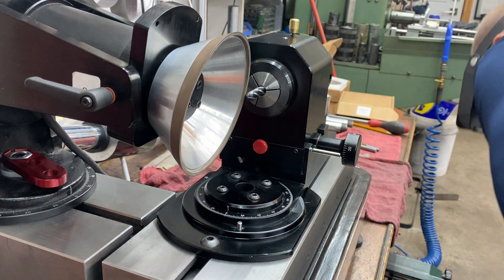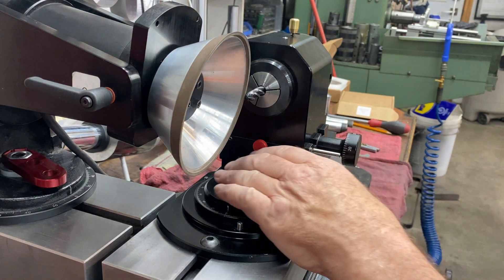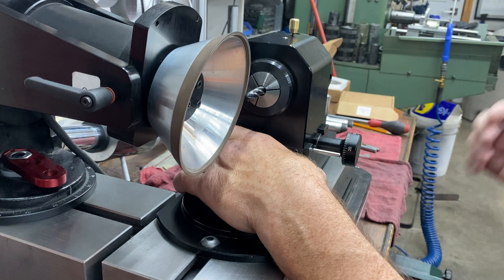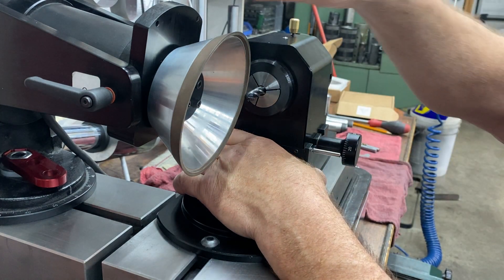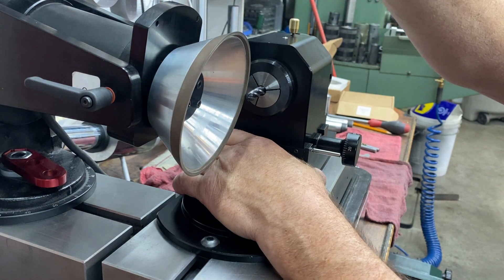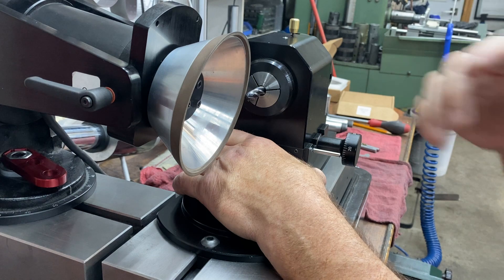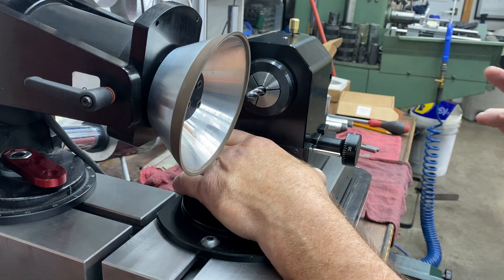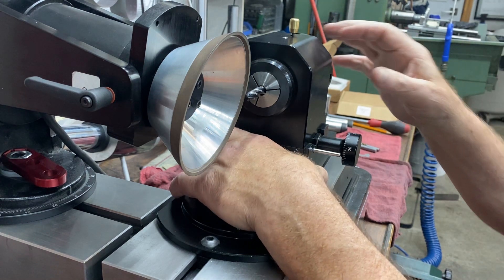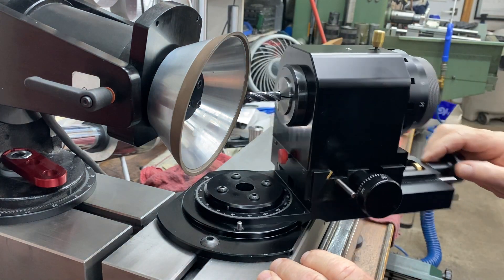This tool that's in here is a ball — a 10mm ball. I'm just going to show you how I hold on to this and index the flutes. We have a little digital readout up there and it's at the radius. So we picked up zero using this edge finder, then I back this wheel away one half the diameter of the tool — in this case it's actually 196 or so. And when I'm grinding the tool, I'm pretty much all set up to grind my rads.